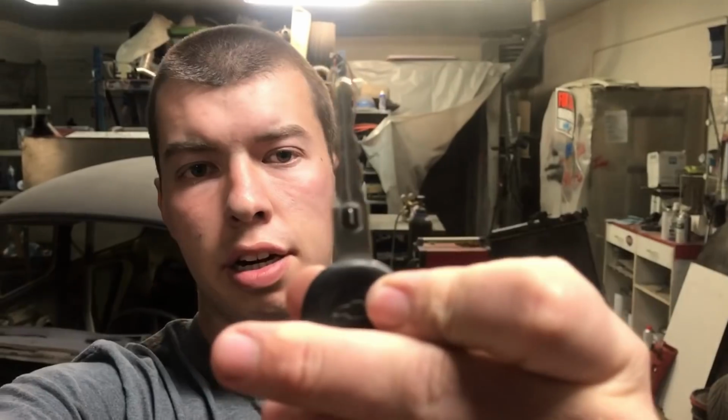Okay, so what I didn't mention in that clip there is that this little chip on the key is actually a resistor. And when these contacts wear out, it can't communicate with the ECU, so that cuts power to the starter. So we bypassed that. I found the mother resistor that communicates with, and I just jumped that to a push start. So you turn the key to the on position, press the start button, fires up. Cool, so that was done.